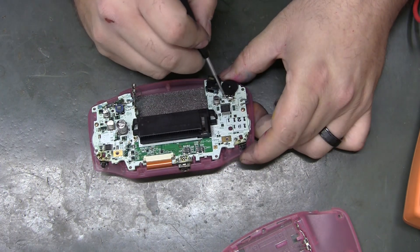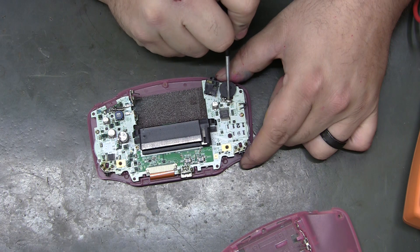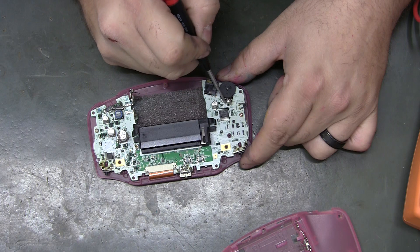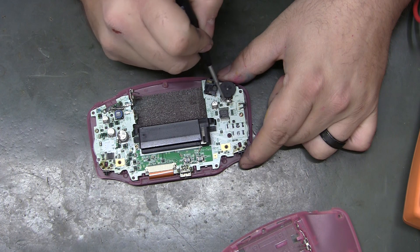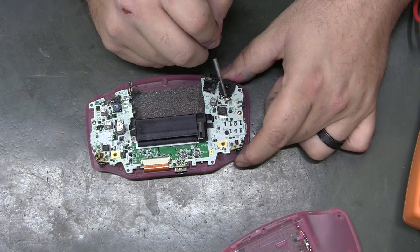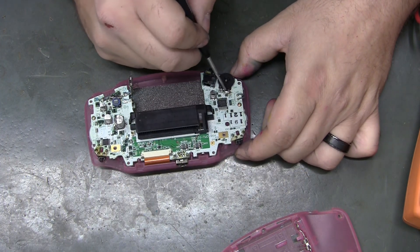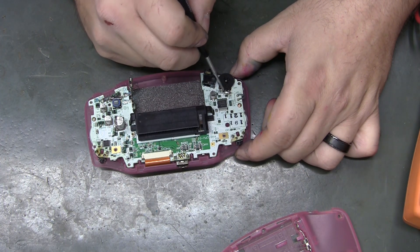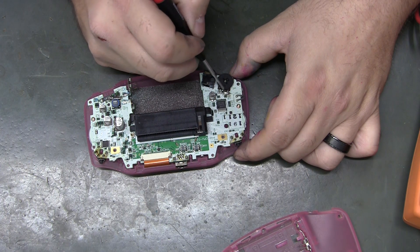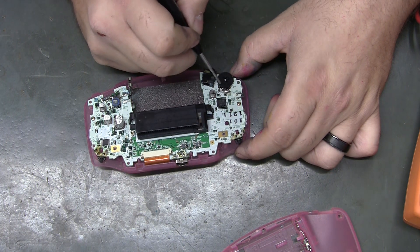The part right here is labeled 1, 2, and 3, with two unlabeled unconnected pins. What I found is that pin 2 needs to be connected to pin 3 to get full volume all the time — you don't need to lay down a component leg or anything. It was a little hard to bridge over that middle pin, but I kept adding solder and it finally made the bridge.